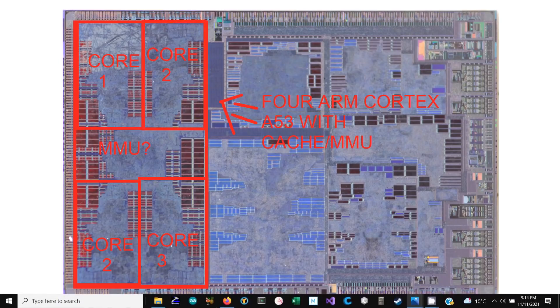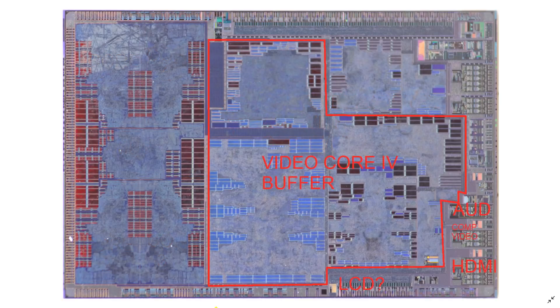That speaks to the original provenance of this chip - it was actually meant for set-top boxes for displaying cable television. The biggest part of the chip, I believe, is what's known as the VideoCore 4, which is a bit of intellectual property Broadcom uses extensively on all sorts of products. The way you can tell is by looking around the IO ring for good hints. We see a cluster of IOs - about enough for an LCD panel here, and about enough for an HDMI port, a composite video port, and audio. The IO is always near the block, so that confirms this is probably the VideoCore 4 block.